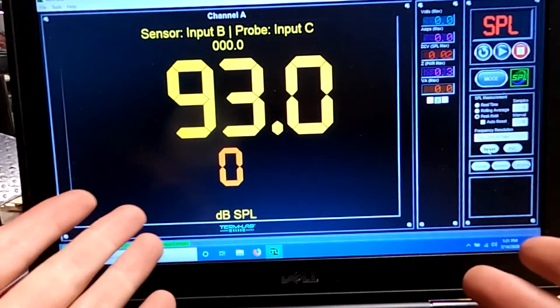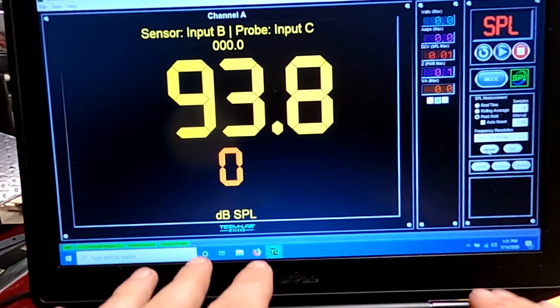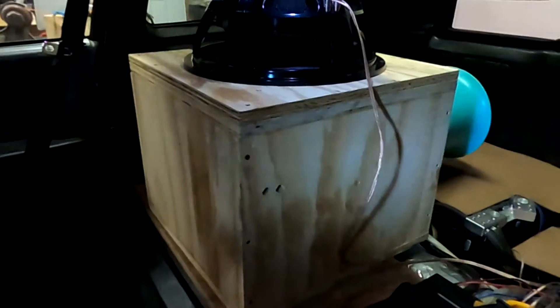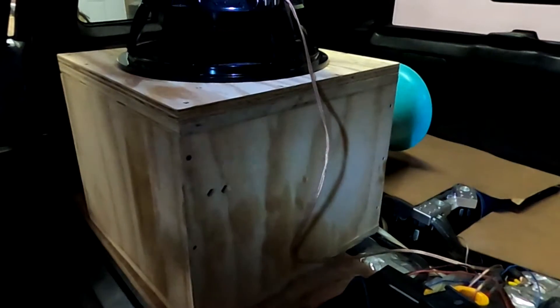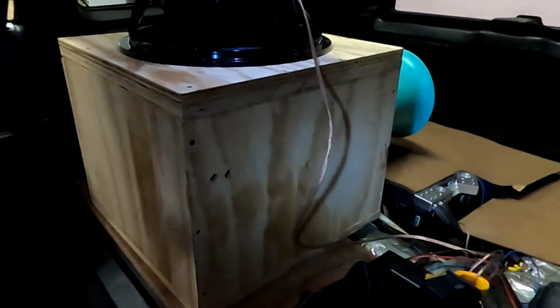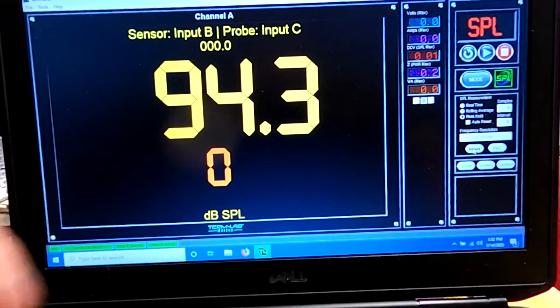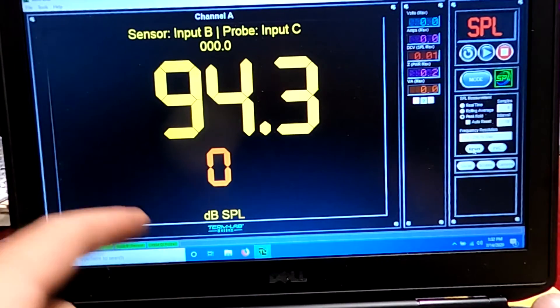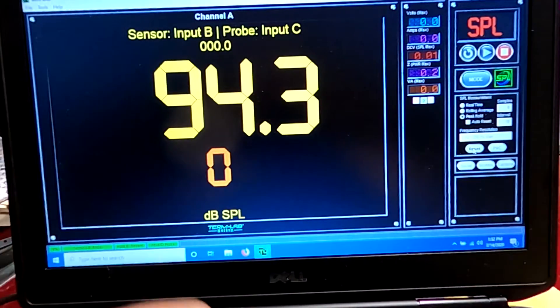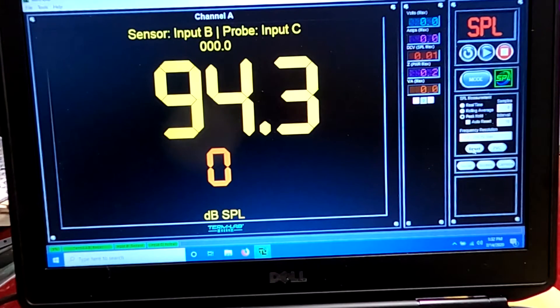If you didn't notice when I was showing all the wire — all the wires are exactly the same length, just under four feet long. I've changed out wire and now we've got the 16 gauge, and we're going to do the same battery of tests to have the exact same comparative data. If you aren't already subscribed, consider subscribing — hit that subscribe button and the notification bell every time we do a new video. Now we're going to do the same power levels: 250 watts, 500, 1000, and then the most I can manage to get out of it.